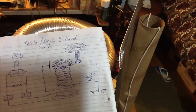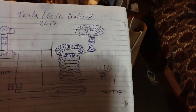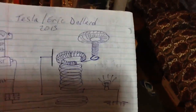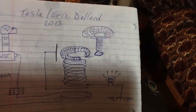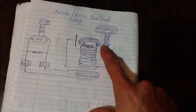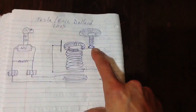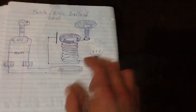It's also important that you put a thicker turn — a half turn on the resonator side on the bottom there. Otherwise it just starts to leak corona all over the place. So just make sure — I'll point at it here — this turn is a half turn. Don't make that into a full turn. You want that just a half turn, not a complete loop like that.